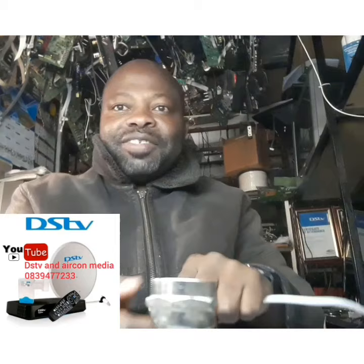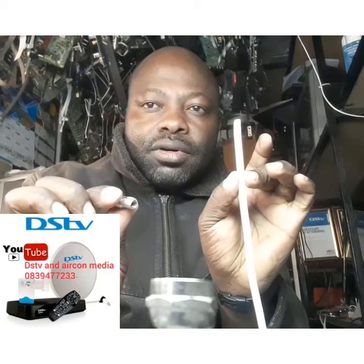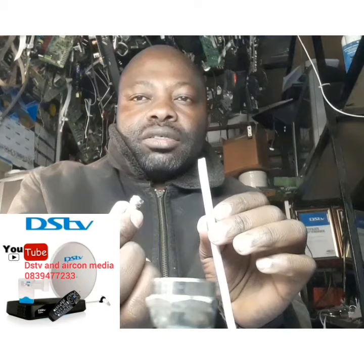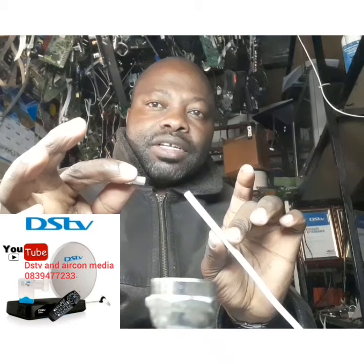Today we're going to learn how to connect your F connector, which is this, to your coaxial cable, or to your connector to your LNB cable for your DSTV. Most of the time we have a signal problem in our decoder, written E48, due to the wrong connection on your LNB cable and your coaxial cable. So watch to the end, you're going to see how we connect it, because there's a little trick to it. If you don't do it correctly, you're going to lose your signal. So follow me.